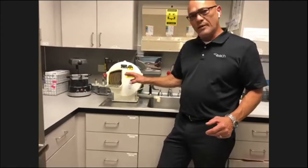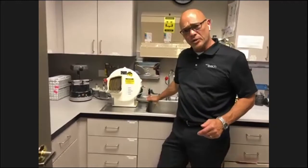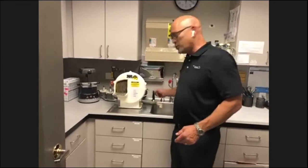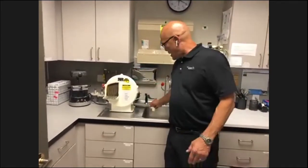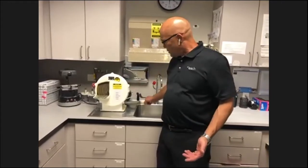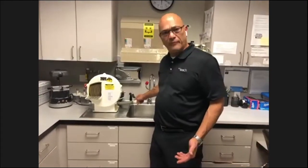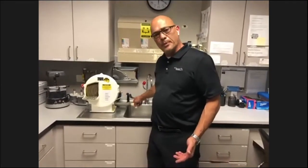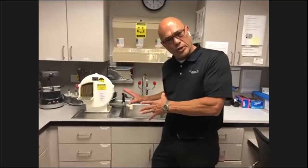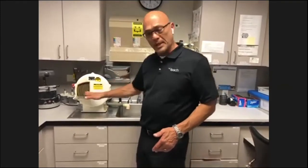So if you're getting a lot of water splatter out here, that's usually an indication of your drain tube not draining well. What I always recommend, every once in a while, maybe every third use, is when you're running it, have the water slosh back in the tube. Lift your drain tube up, if it's flexible enough, and get that water sloshing down, and it'll flush out a lot of the debris from the tube. But plaster on the wheel is usually an indication of a drain tube problem.